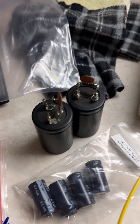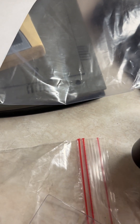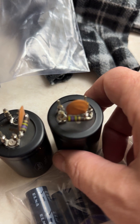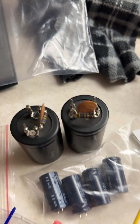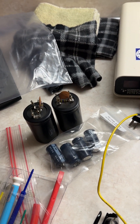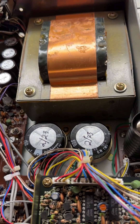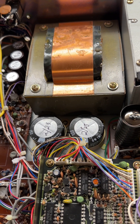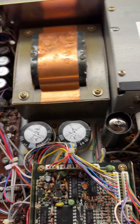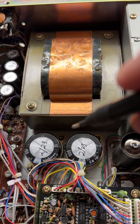Here's the old caps. They were kind of bulged on the end, and one of them was kind of cracked around one of the terminals. So what I did is I bought new ones from K4EAA.com. Those are right there — they've already been installed. These are nice Nichicon caps that they sell there. The really good thing about these caps is the diameter is the same as the old ones, so you can use the same mounting bracket with them.